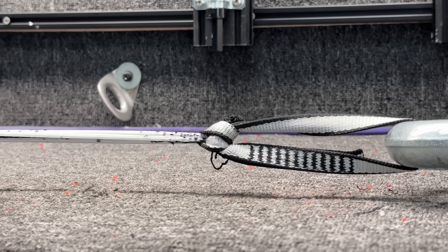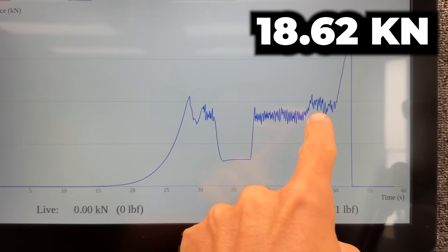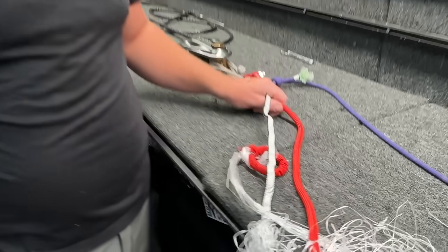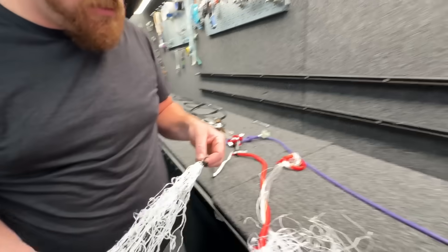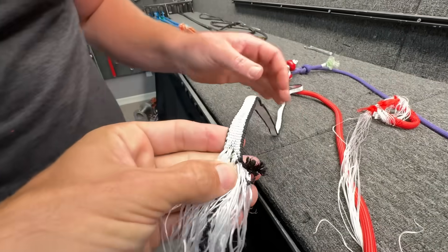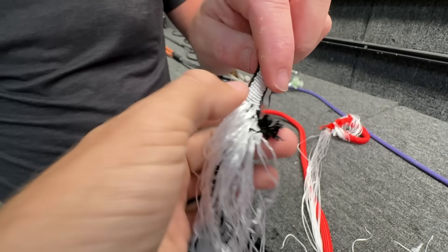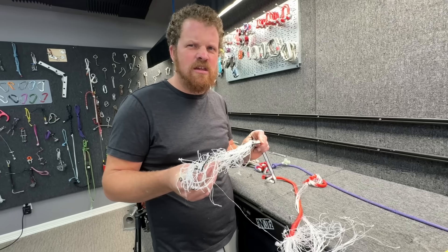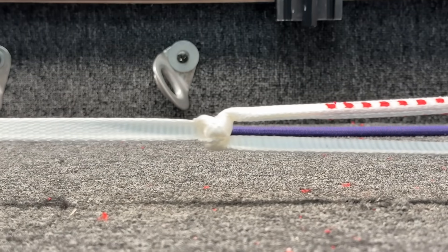Stripping the black edge off — it was 10 kN all the way up till that point and then we got 18. What! That is neat. Can you see the difference between the two ropes? It was unweaving as it pulled along. I think these black fibers are the things that go back and forth holding the white fibers together. Have we seen this result in an HMPE sling? Nope. Today's a new day.